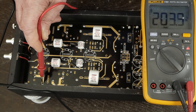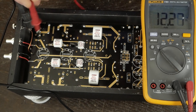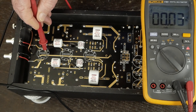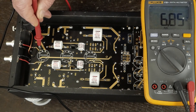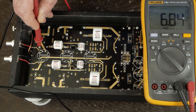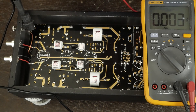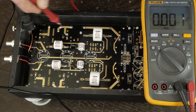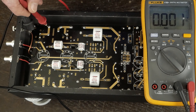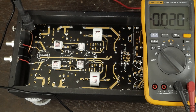So again, this channel is 203, and this channel that was super quiet — we only got 12 volts. We come over and check the plate voltage on this input tube: 83 volts, 8 volts, and 7 volts. So clearly, between this point and this point, we're having a huge voltage drop. Either this resistor is bad or we've got a bad solder joint. The first thing I'm going to do while the board's still in the preamp is reflow the joint on this resistor here and here, and see if that changes the voltage readings.